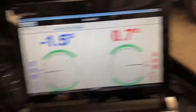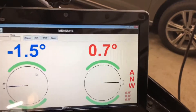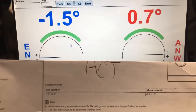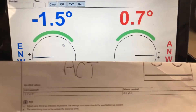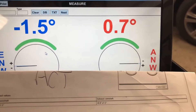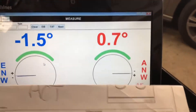Those are the specifications and now if we compare them to the specs we've got — it's in tolerance on the inlet, so you get minus 1.3, plus or minus 1 and a bit, so that's your tolerances — absolutely fine. And then on the exhaust camshaft, which is red, you've got plus 1.8 for the tolerance, so plus or minus 1 and a half — absolutely spot on.